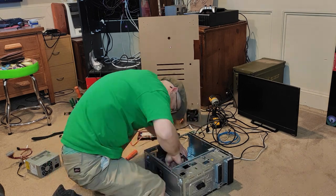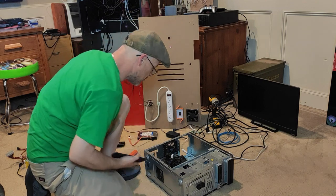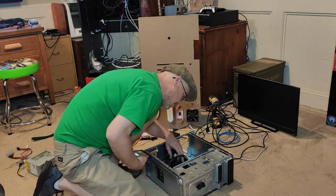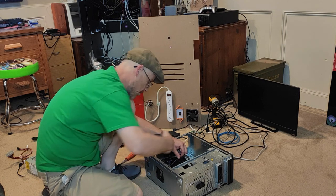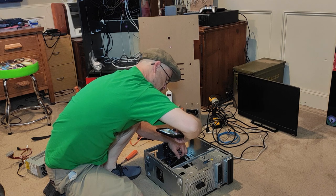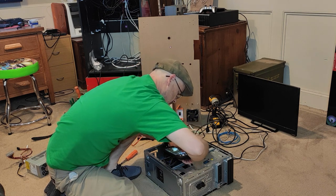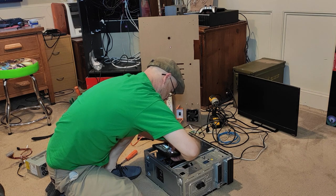I will install as much as I can today, and we will make a video about these mods as I go. I like to take pictures of where each cable plugs into. This makes it easier to remember where each cable needs to be plugged in. This isn't really important for most of the cables, as we all know how to identify the common ones, but it is helpful with front-facing USB ports, power buttons, and things like that.